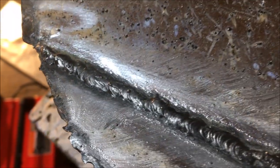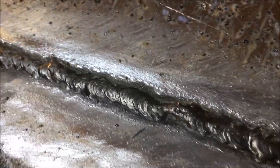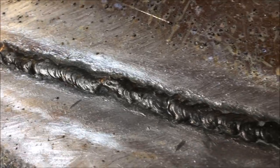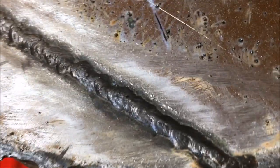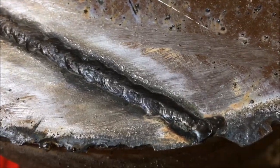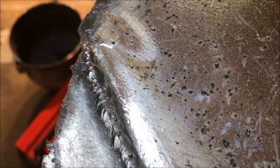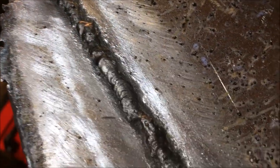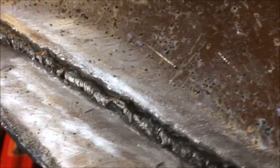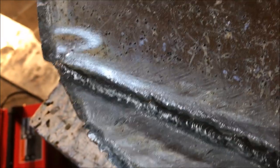There's a little bit better of a bead here, still total flunky work, but I think it sealed the part up. I turned it down a bit so it's running a little cold and I'm moving a little too fast. But at either rate, I'm definitely loving this flux core — it's so much better than stick welding, far less slag to deal with, and I think I could get good at this with enough practice. I've only got about five hours of welding in my whole life total, so I've got a lot to learn.